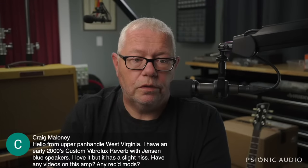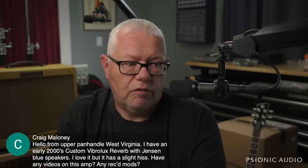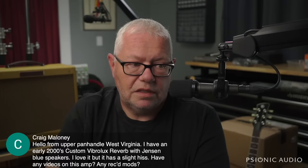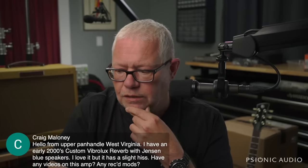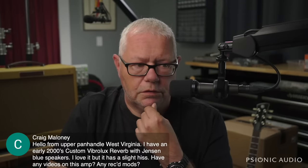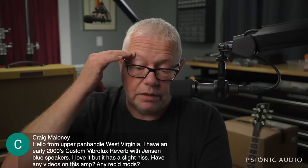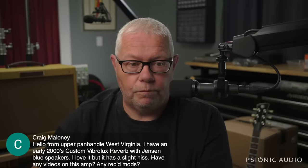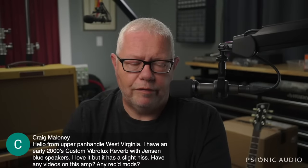All right, so Craig Maloney, hey Craig, West Virginia. I have an early 2000s custom Vibrolux Reverb with Jensen Blue speakers. Love it, but has a slight hiss. Any videos on this amp? I'm pretty sure the custom Vibrolux reissue has the same split plate arrangement that they used on the Vibro Verb. That might be an area where you would look into it. A lot of them will have a slight hiss.